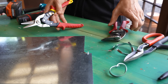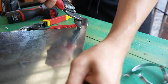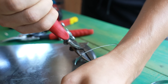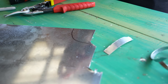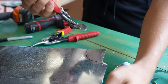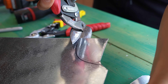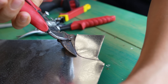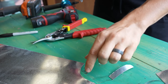This one I had to hold straight to cut it. The offset snips I hold at an angle like this. They work very well to cut out circles. As for the colors, red is good to go counterclockwise and green is good to go clockwise. I don't have the green one, so I can't show you an example of that, but when it's offset like this I can actually see the line and where I'm cutting. And they're a lot easier to turn. Nice, clean cut.